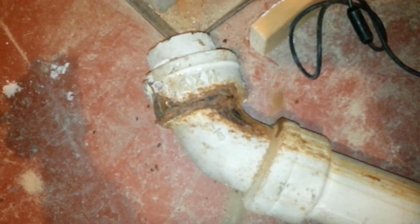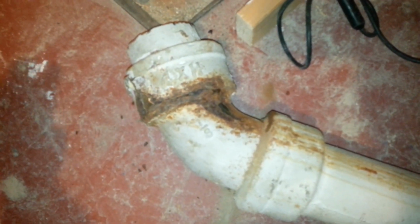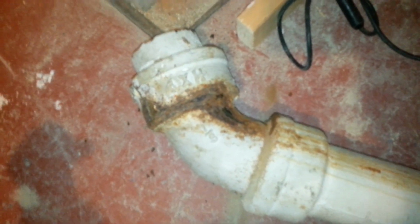So this pipe will come down into this hub, and you can even see there's some oakum. So the oakum will get packed after the pipe was inserted. It would get packed with oakum, and then molten lead would be poured over the oakum. Then when that cools, it would get worked in with a caulking iron, and that's pretty much what's happening here. But the new material will be no hub, and we're going to be using 4-band clamps. There's nothing wrong with 2-band clamps. It's just that this is a sort of high-end application, and I feel that the customer should be using 4-band clamps.